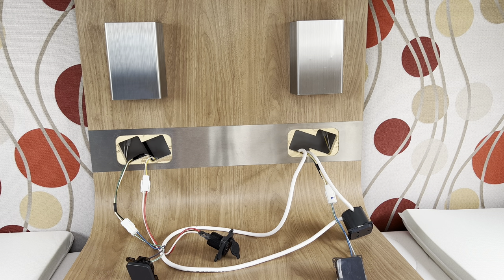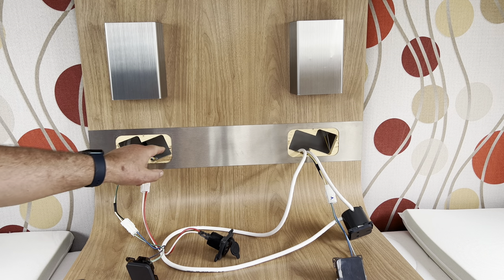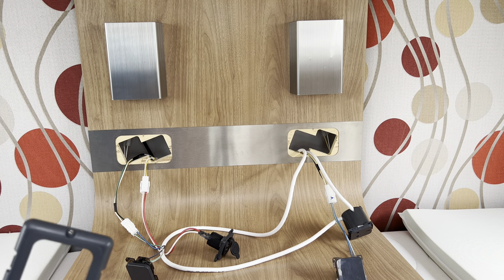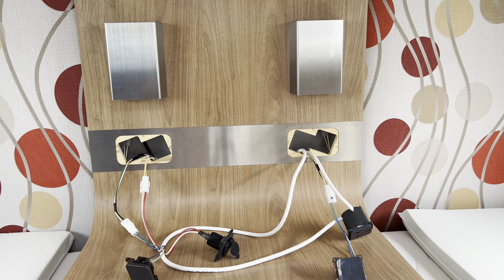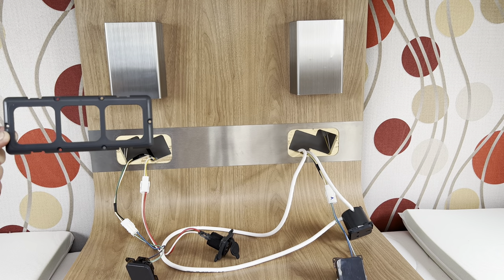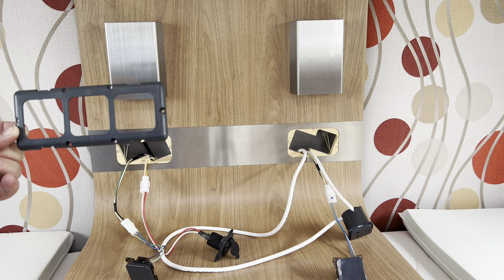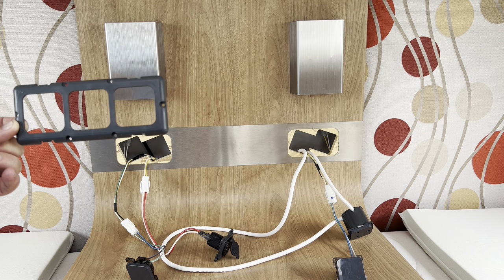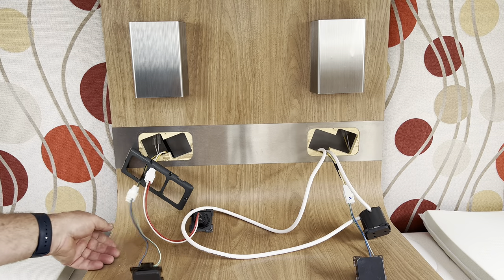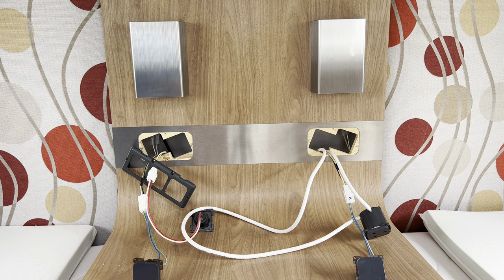What we've got to do now is offer the backing plate up and see where we've got to cut. Bailey always cut out square holes, but I've only got a round hole saw, so I'll be cutting a round hole out. What I'm going to do is put the face plate over the original screw holes, draw around it, and see where we've got to go. I've put the triple plate on and pulled the wires through so they don't drop down the back.